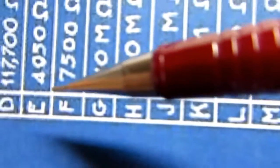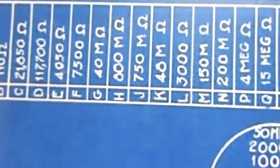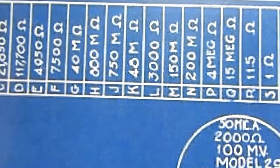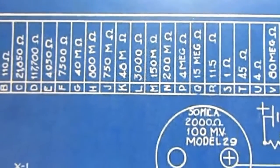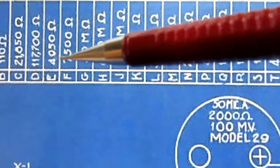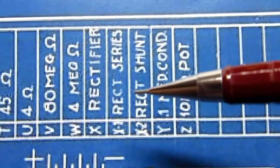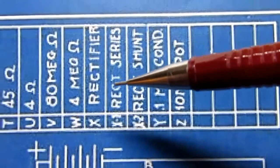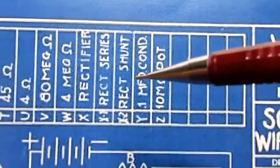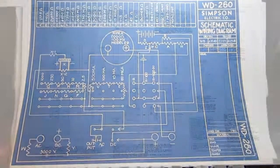First I thought it's just a sloppily drawn 9. It's like, no, I think they intended to draw a 0, but maybe the draftsman was working off of a sketch and somebody didn't make a very well formed 9. That's all I can think of. Anyway, if one does the math on the circuit, a 4050 would not work where a 4950 does. And then finally I took physical measurements of the 2 wire wound resistors associated with the rectifier. And all of these corrections I put on my own version of the schematic. There it is.